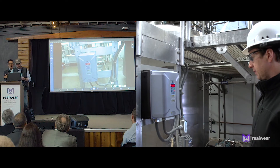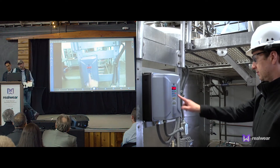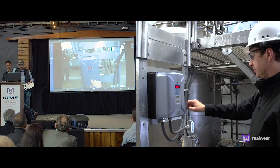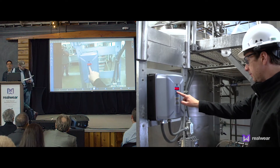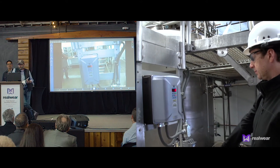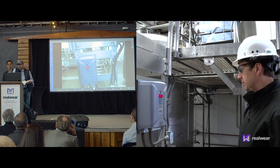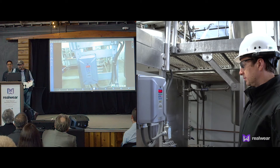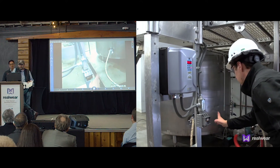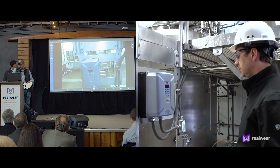Now we are going to lock out forward and reverse so the pump only runs in forward. I'm going to need you to hit that up arrow key so it reads P231. Two, three, one — perfect. Go ahead and hit program. Use the down arrow key and set that to zero. Hit program one more time for me. So we programmed the two parameters to save them. We're going to go ahead and turn the control off — flip that black rocker switch off. You'll see a shutdown procedure saving everything, and we should be all set.